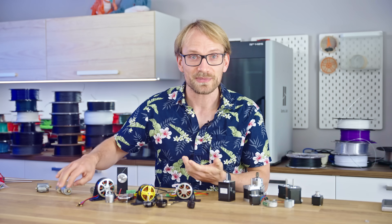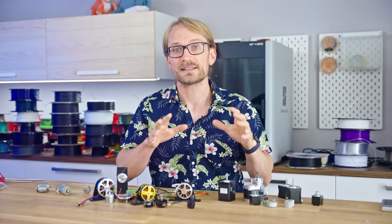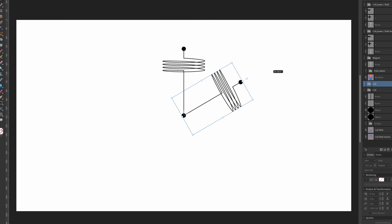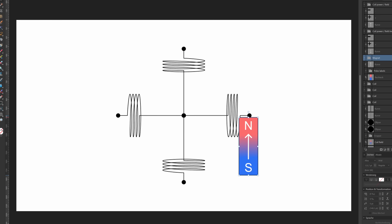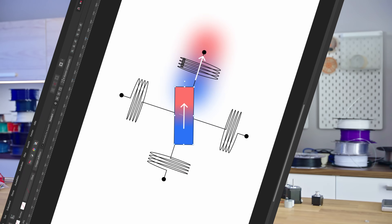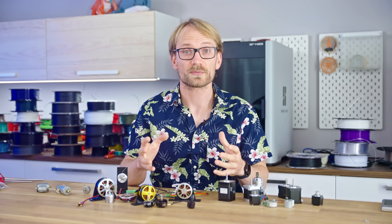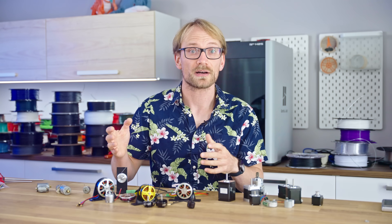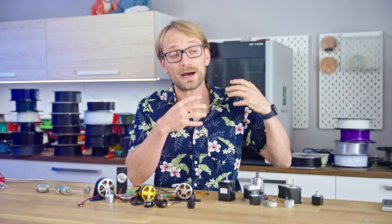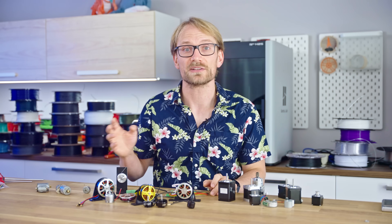But what does that mean? For all intents and purposes, a permanent magnet DC motor is always a combination of a set of electromagnets and a permanent magnet. Sometimes the magnet spins, sometimes the coils that make up the electromagnet — when you get both of them spinning, something has gone wrong. The hardest part is turning the electromagnet on and off at the right times and with the right polarity, and how you need to do that is also the biggest difference between these motors.